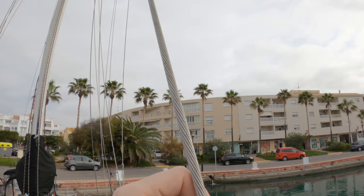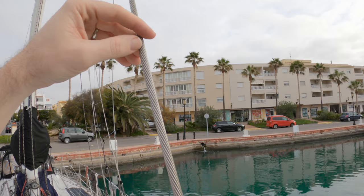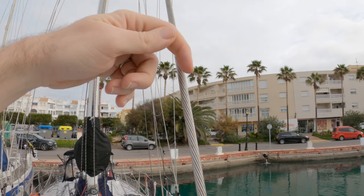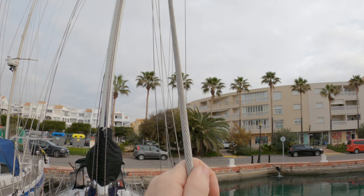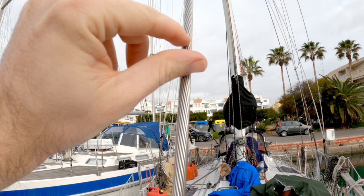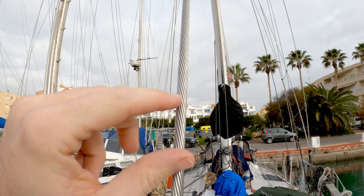Most importantly — and these are super hard to spot, which is why they often go unnoticed — look for horizontal cracks in the wire, which mean the wire has been overstressed and has actually snapped. Often the wire will lift up and you'll see a raised wire running along the side of the stay, which is an easy way to spot failure. But sometimes wires break and just stay put. You also want to look for tiny horizontal notches cut into the face of the wire — teeny tiny notches that indicate wire damage.